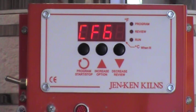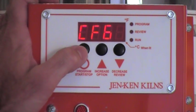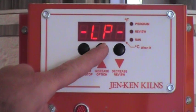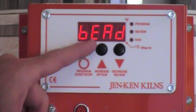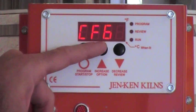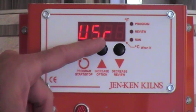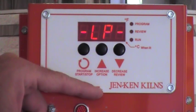The operating manual will have all those abbreviations for you. Once it's in the configuration mode, one keystroke of the program button will get us into the program mode. By using the up arrow key I can toggle between all of the available programs: large piece, small piece, bead programs, precious metal clay programs, and user programs — which are user-defined programs where you design your own firing schedule. Keep in mind that every one of the configuration modes has available slots at the end where you can design your own firing schedule. And then back to large piece.